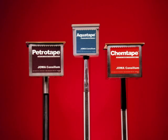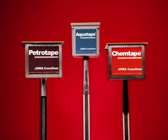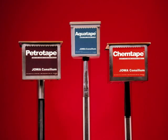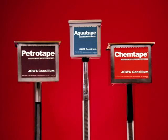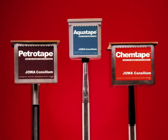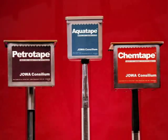We offer three different models: PetroTape, AquaTape, and ChemTape. As the names imply, they are suitable for water-based, petroleum, and chemical applications. These packages include a sensor, housing, and loop-powered 4 to 20 milliamp transmitter. The difference between the models is in the material used for the outside jacket and the protective channel. AquaTape has a polypropylene jacket and channel, while the PetroTape uses a Hastelloy jacket and nylon channel. The ChemTape also uses a Hastelloy jacket and is suitable for over 400 chemicals.